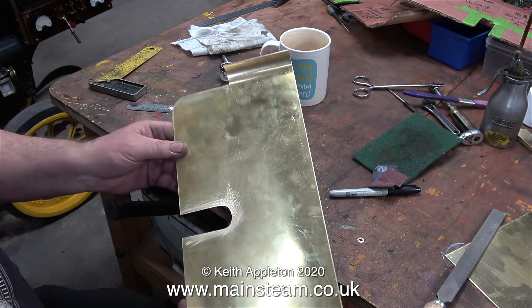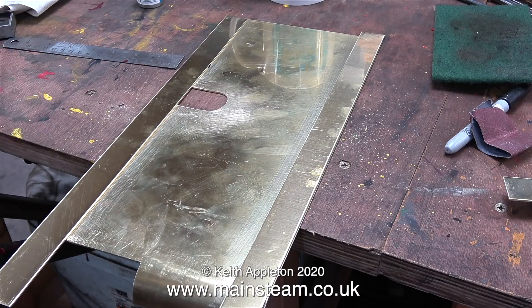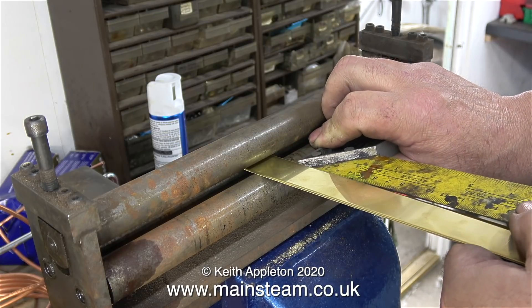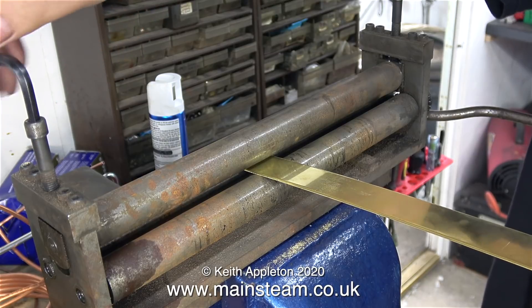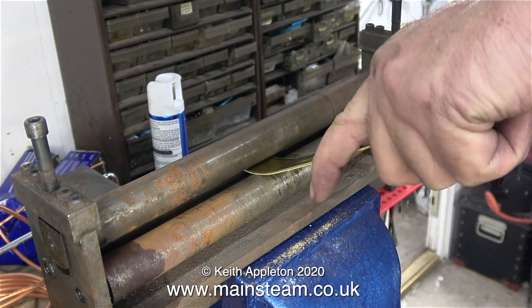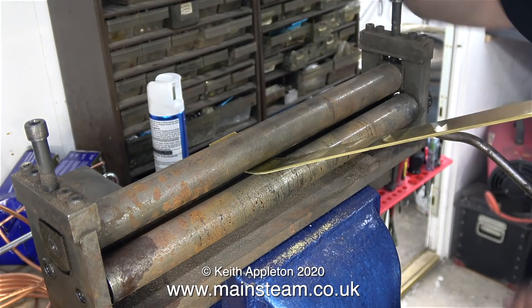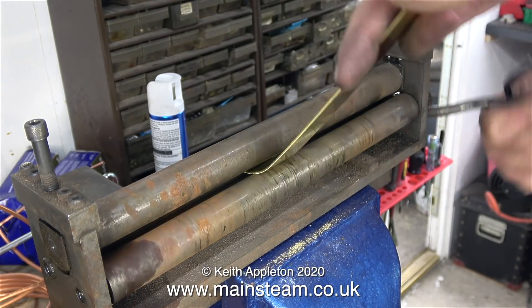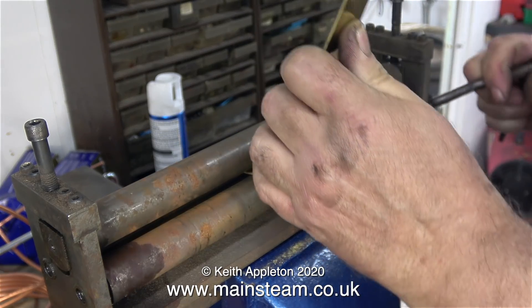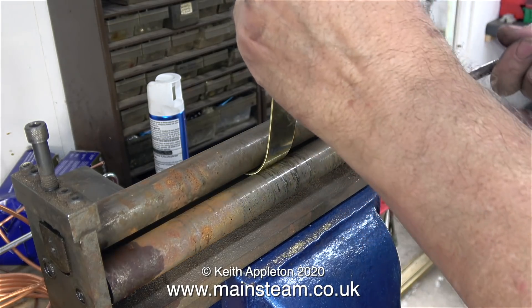Here's the progress so far on the right hand side plate. Until it's fixed in position it's quite difficult to hold it perfectly level, but you get the idea. I intend to fit brass edging to these side plates, and on the right hand side plate the bottom part is going to be very easy. Time now to bend one of the pieces of trim to match the side plate — this needs to be bent very accurately. It needs to be slightly larger so that it fits neatly on the outside edge of the plate, and it is also very important to make sure that the part being bent is perfectly in line with the rollers for it to look okay.